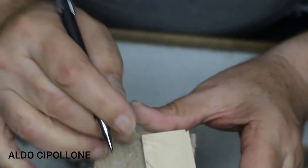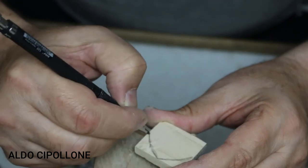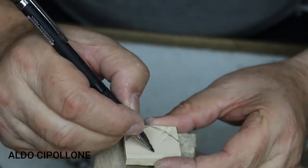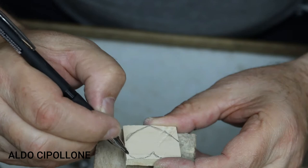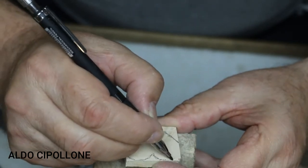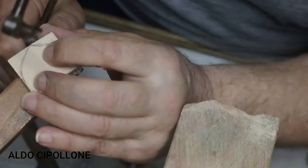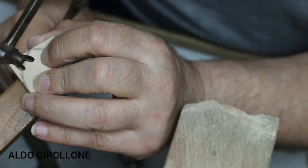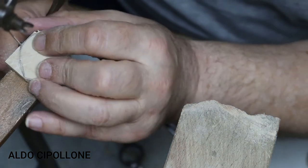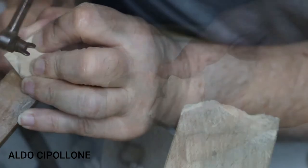I'm drawing the heart shape on this piece of wood in pencil. I found the centres using the vernier gauge and I'm roughly drawing the heart shape. I'm using the number two saw blade — this will cut through the piece of wood quite easily, not to be confused with the 2-0 which is quite fine. I've got it on the sawing peg, which swings in and out of position.